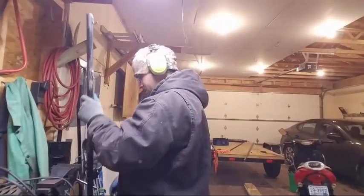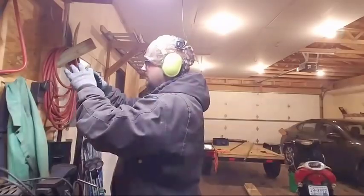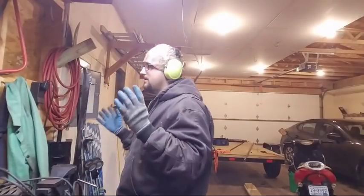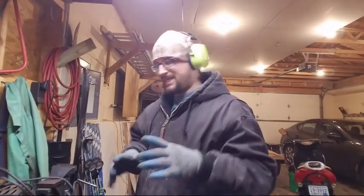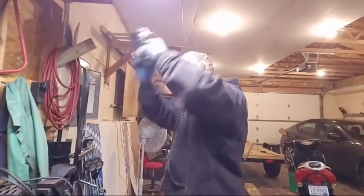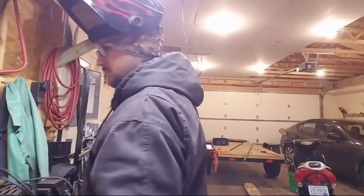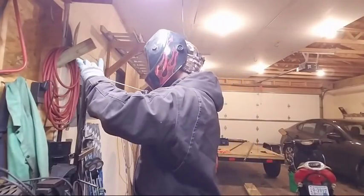All right, so this will be the fun part. I have a feeling this is going to give me a hard time. But we'll try. So, all I gotta do is weld this little piece on the top of this tube. How hard could it be? So I think I'll get it on here, I'll tack it, two sides, and then I'll lay it flat and I'll just do like a quarter bead at a time. Turn on the box here. This is going to be really fun. Yeah, we'll use a full length rod because I just ran out. We'll try it here. We'll get it.